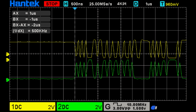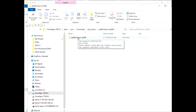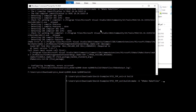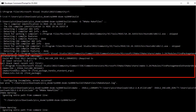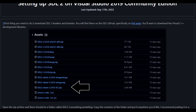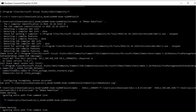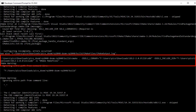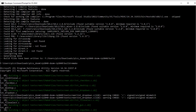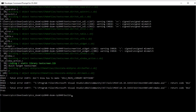Now that I know this hardware configuration works, I'll increase the difficulty of this project a bit by compiling the UF2 file on my PC from the source files. I downloaded the Doom file from GitHub, but it wouldn't compile since I needed SDL2. So I downloaded SDL2, but I couldn't figure out how to incorporate SDL2 into the build. Finally, I added the paths into the cmake statement, only to find out that I needed SDL2 mixer and SDL2 net. So I added them and finally got past the cmake stage, but then it wouldn't nmake. Finally, I had enough of trying to do it with Windows.